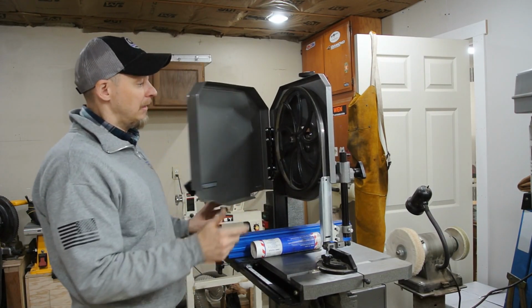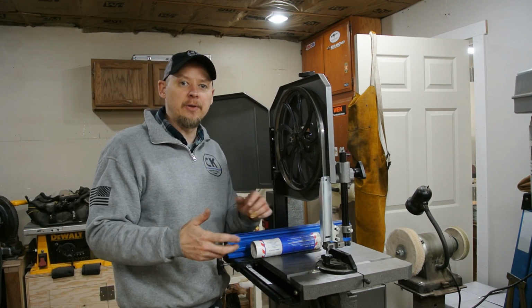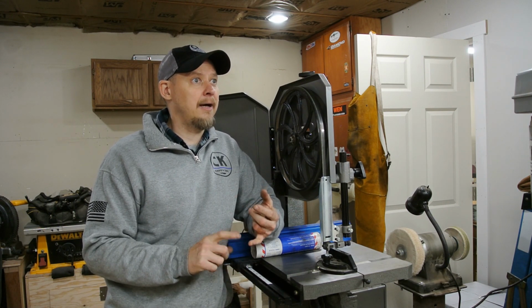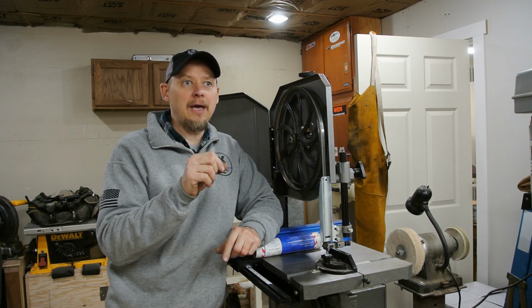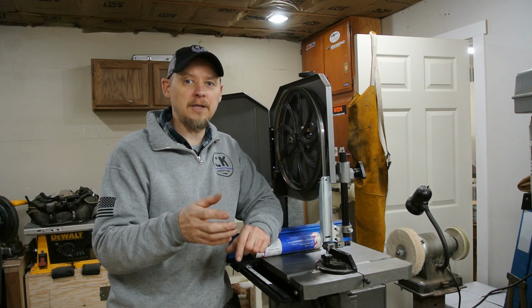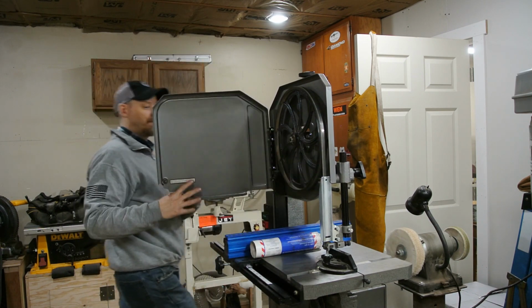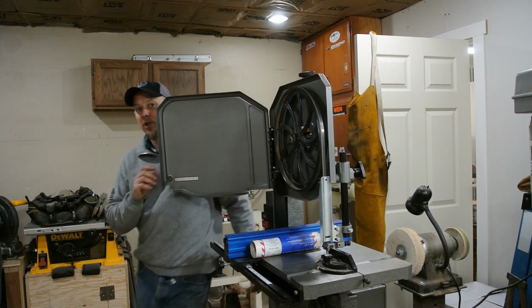Now, touching on the blades as well. When I first did the video and the release, I did a 2-part series. I took it apart, then I was missing some things, so I came back and did another quick video on it. I mentioned some of the blades I got: a 10/14, a 14, and another one which was pretty heavy and aggressive. All 3 were bimetal blades. One had a pretty big tooth, and that was for processing my scales, all the wood. The one that's in here now is the 10/14. Yes, this is the 10/14. I started using it July 3rd of 2018.